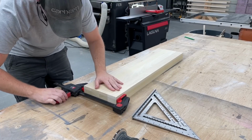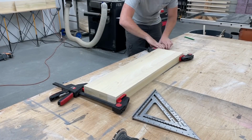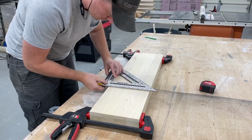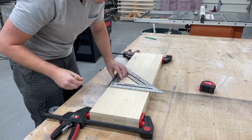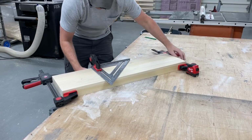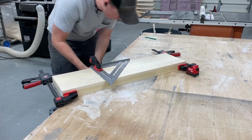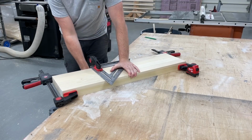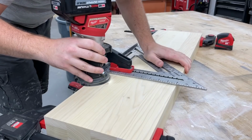Again, these details are pretty similar to the rest of the set, which I have videos on if you haven't already checked them out. This time I wised up and clamped all 4 legs together to make the process way faster and used a 12-inch speed square as my router guide. I typically use these for rough construction where complete accuracy isn't crucial, but for something like this you just want to make sure your square is actually square, which out of the 3 I have, this is the only one that truly was. To make the cove, I used this Freud 3/8 radius round nose router bit.